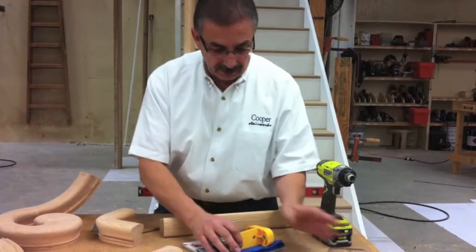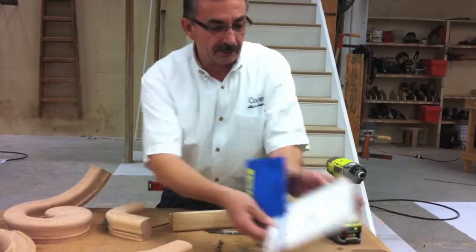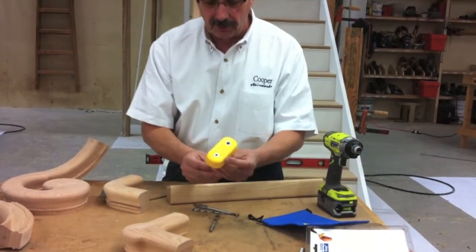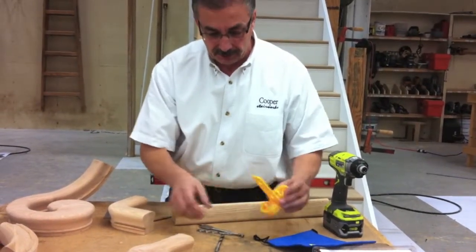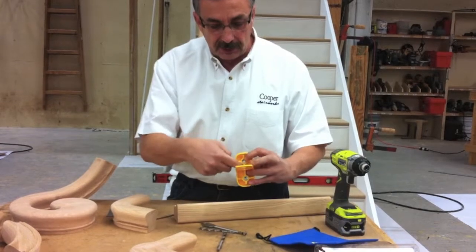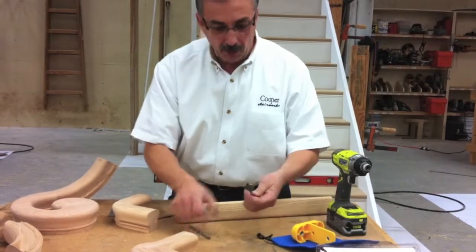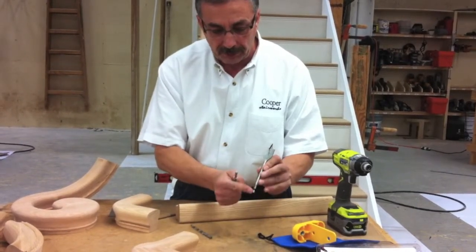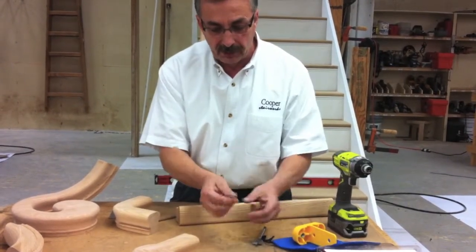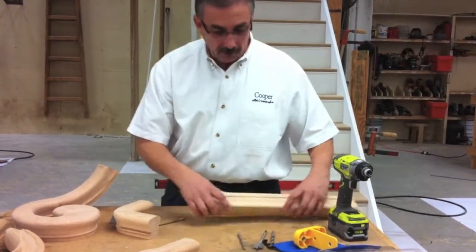Okay, let's get started. Take your parts and pieces, everything you need to connect two pieces of rail together, rail and fitting together, all in one spot. You have the guide itself, which has hardened steel inserts, hollowed out in the back of the guide, so when you drill, the sawdust doesn't get trapped in between the piece and the jig itself. These windows are for alignment. You get a 1-inch speed bore bit, quick disconnect, a 3/8 hardened steel bit with a quick disconnect, and a 1/4 inch bit with a quick disconnect also. So you're ready to go.